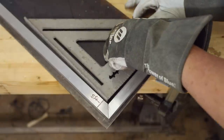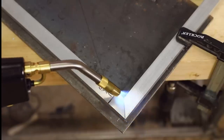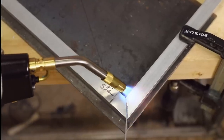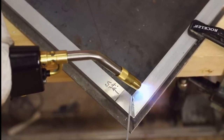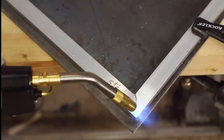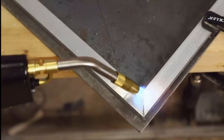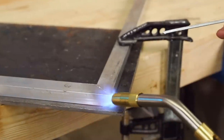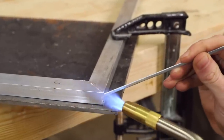Next up is brazing. The trickiest part is figuring out how to clamp the pieces down while you're brazing — obviously you're shooting a flame at the metal. I just got creative and threw down a scrap piece of steel plate. You need a little patience; it takes about a minute for the aluminum channel to get up to the right heat. You're not actually melting the rod — you're heating the aluminum up, then touching the rod to it. Since the rod melts at a lower temperature than the aluminum, the heat from the aluminum itself will melt the rod onto it.